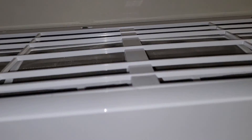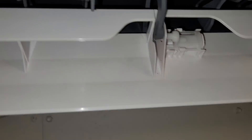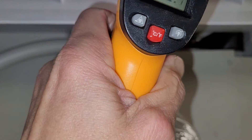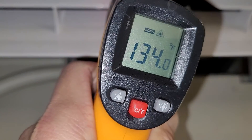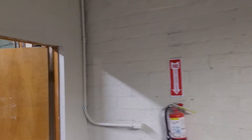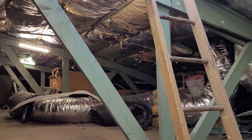The air comes through here and that needs to be conditioned. It comes out here and goes through to get heat or cool — it goes through a coil. In the wintertime, this coil is about 134 degrees right now, so that's enough to take care of this room easily. In the summertime, it's around 34 degrees, so that's enough to cool here.